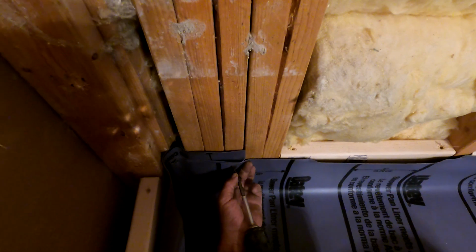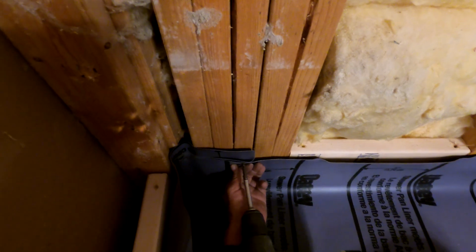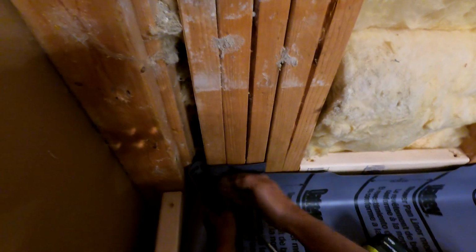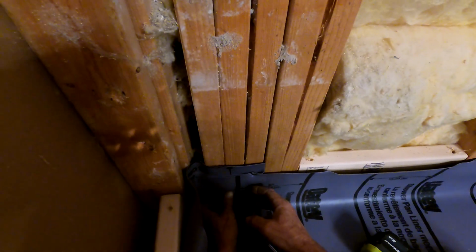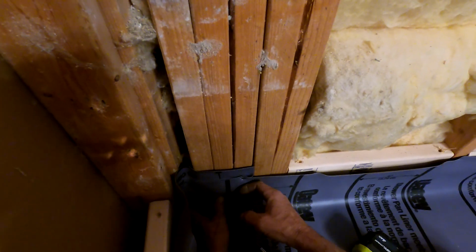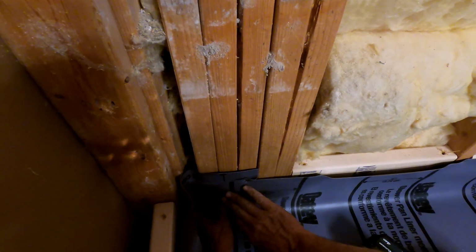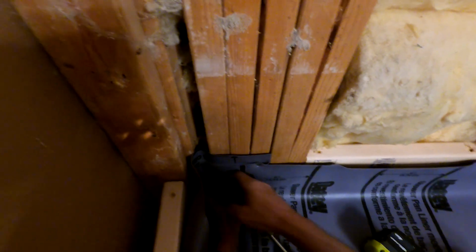This is a bump out I was telling you about. So I usually hit that bump out right on the corner just to flatten it down. Now, having said that, there's still a bump out with that fold, right? The fold's on the inside. And so when the wallboard goes over it, there's maybe a 1/4 inch bump out over here. But it doesn't matter, because as you're screeding out your thin set, this area is going to get a little less thin set, and then you're just going to go hog wild on your thin set over here. You just know that as you're doing the tile. So that bump out's never ever bothered me, not once.